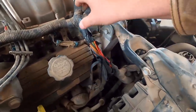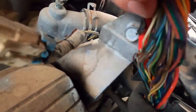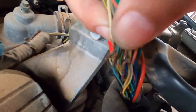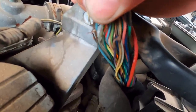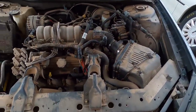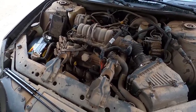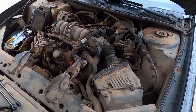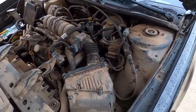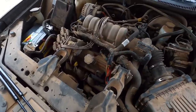When I got under here and pulled back the insulation, this is what I found — these aren't just bare wires, these are cut metal wires. Some of them are completely disconnected, 100% not touching anymore. That's our problem. This car was given up on because of a fairly simple wiring issue that required no more than about 40 minutes of poking around online, printing out a schematic, and checking wiring with an ohm meter.